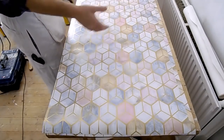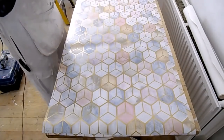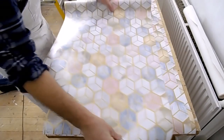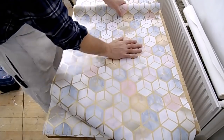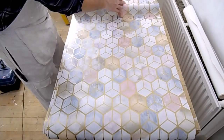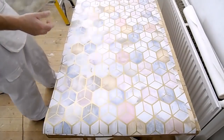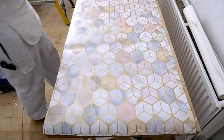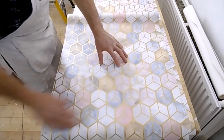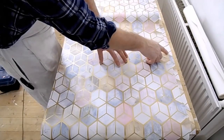So what I need to do next is, using one roll, work the first length. So look, the match is straight with no waste. The match is literally straight there. Right? Now what I do then is cut that, and that will stay as my first roll for cutting my first pieces. Then what I would do is get another roll out, work out the second piece, and then cut that. Now that roll then would only be for my second pieces.